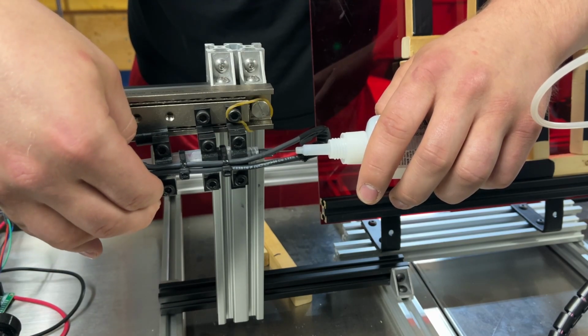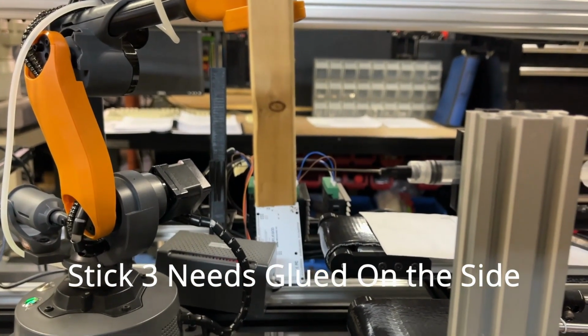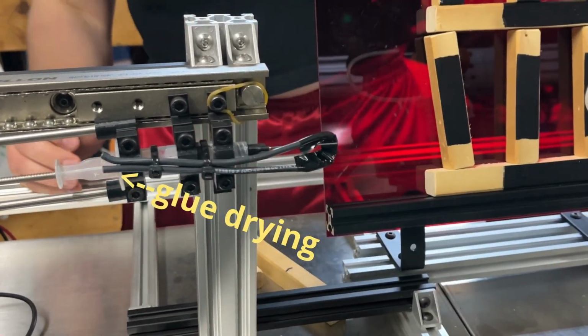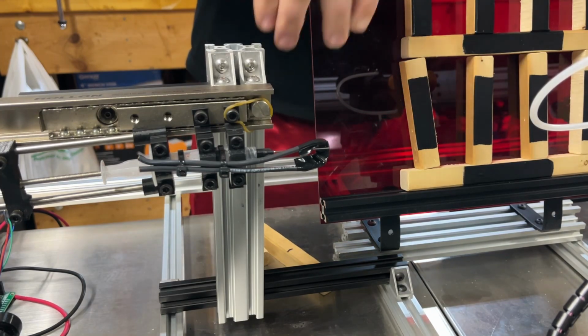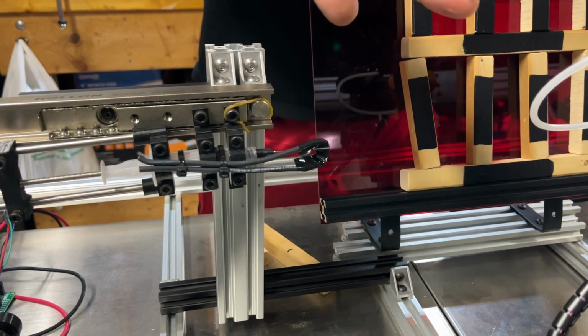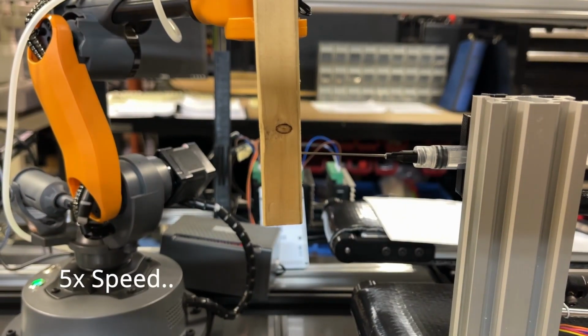Only as I was testing, I came across some issues with the Mirobot. Because of the scale of the Mirobot, it doesn't include any sort of homing or positioning sensor for the sixth axis. And this axis is very crucial for getting long parts to line up perfectly with the glue needle.